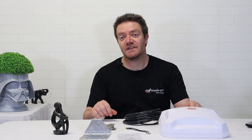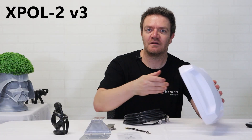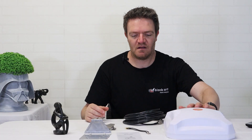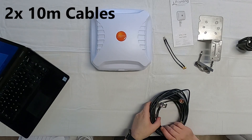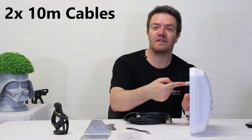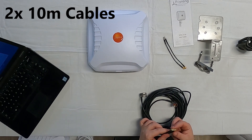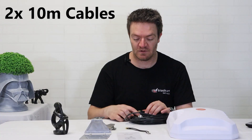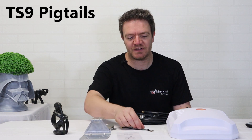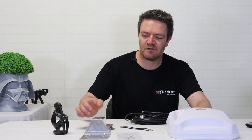The contents of this kit include the antenna itself — the Poynting XPOL-2 Version 3, the variant with two N-type connectors at the back. We also include two 10-meter cables with right-angle N-type connectors, because right-angle connectors fit perfectly on the back of the antenna, allowing the cable to run straight down. The cables terminate in SMA at the end, giving flexibility to connect to a wide range of products, and of course the two TS9 pigtails for complete connectivity to the vast majority of routers.